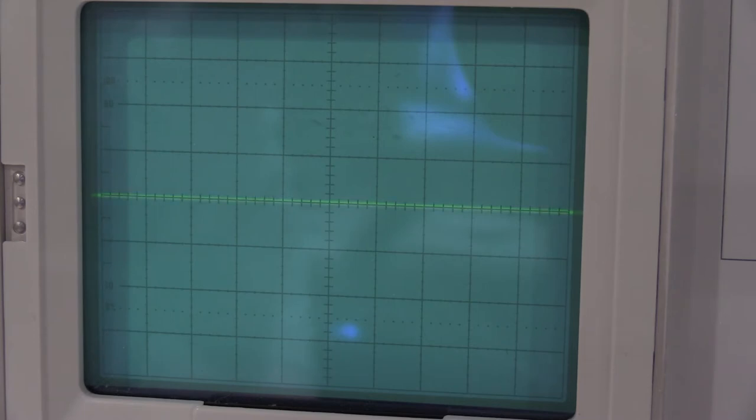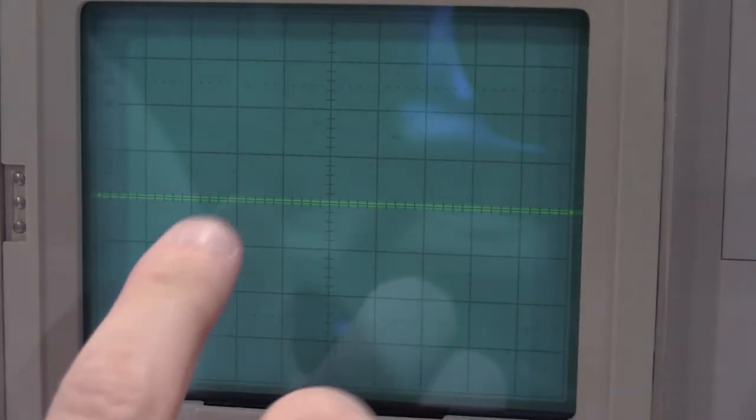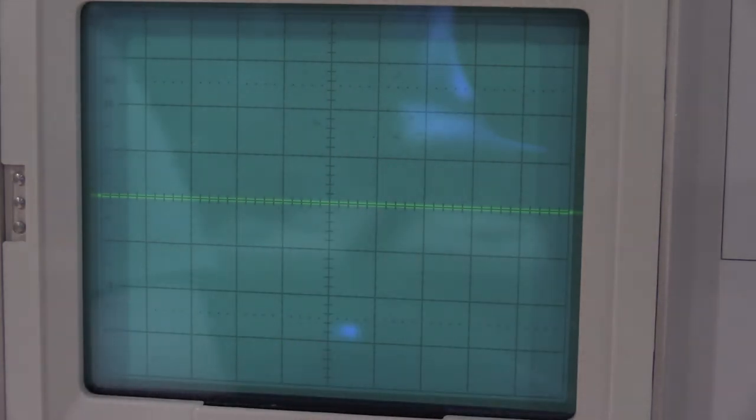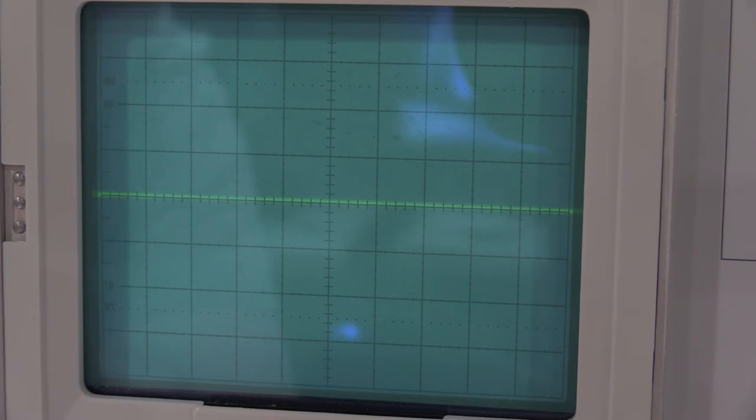I'm not even going to mess with that one. Turn on the readout real quick. We're down here now. That one's fine. The spec is it's not supposed to move a half a division, so a half a division would be way up here. So when I switch it, it shouldn't move within up here. But that's all it's moving, so no need to adjust that. And we can probably trim that up a little bit. It's within spec, but I could probably improve that just a little bit. So that's the channel 2 DC balance,